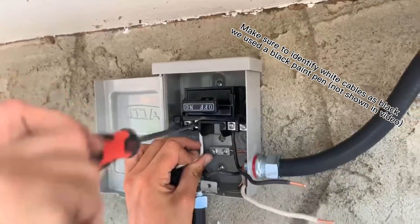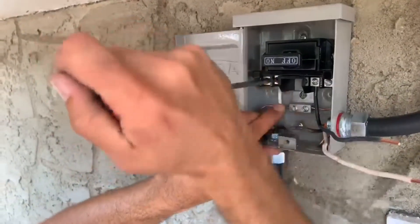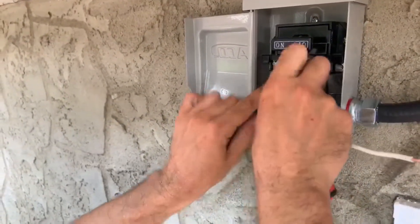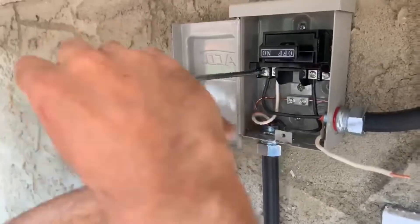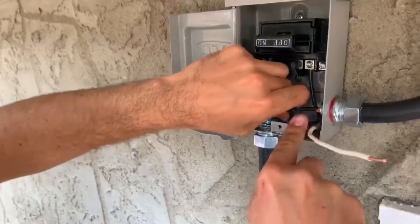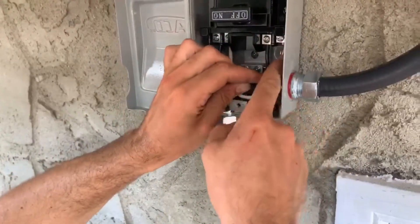You always want to make sure that these connections are tight. You always do a pull test after — pulling down on it and making sure it's not slipping out. Then tighten it up again, because you'll create a little space in there after doing that. It doesn't matter which side goes on either one — you could do black-white or white-black — because all you're trying to do is bring 240 volts out of here. This is all still single phase, so it shouldn't matter which colors you're doing on what.